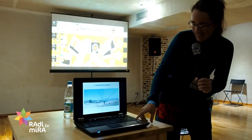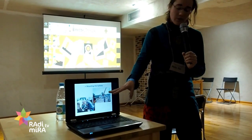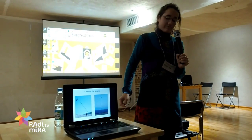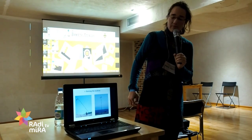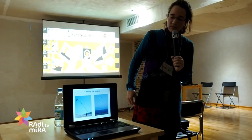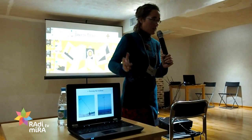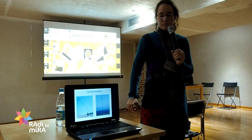So, then we connect the turbine at the top of the tower, and we raise the tower and the turbine. Then, when the tower is ready, the generator itself, the rotor, is attached and is raised up with it. So all this process of the tower can be done with only 3 persons. Yeah, it's fine. And to mount and raise all this, 3 people are enough.